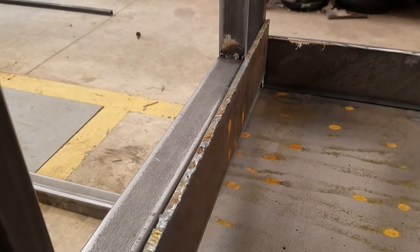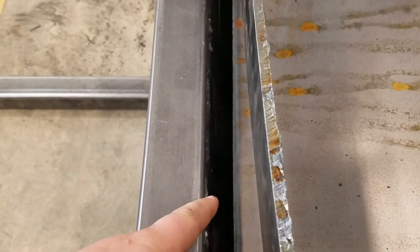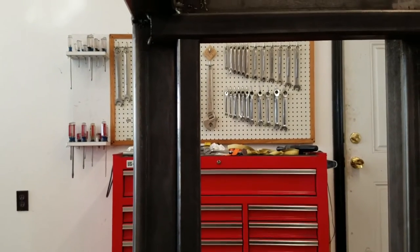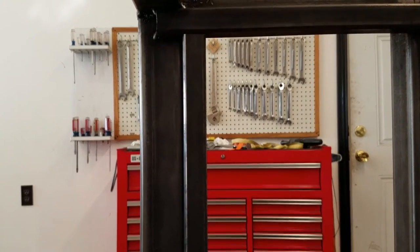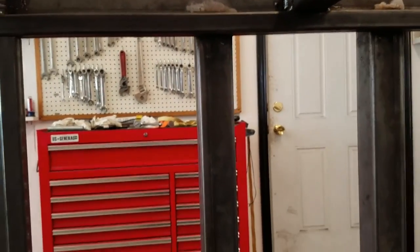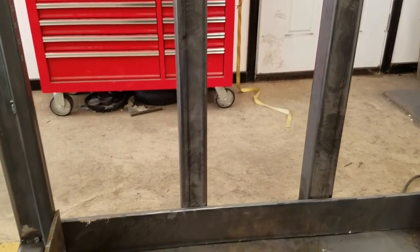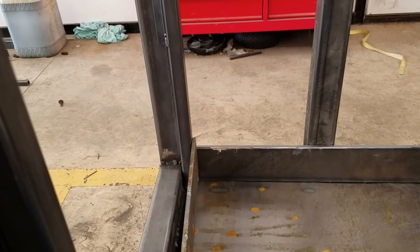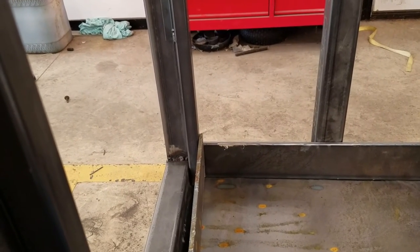That's probably going to flip over so we don't see it, or we may just grind it down smooth. When this gets ground in to fit, it's going to come over to the edge of the water pan, and then there's going to be a one-inch gap where the smoke and the heat come from. We'll have a panel on this tubing, and then an inner panel that runs all the way up — the inner panel is going to come up on that one inch and stop about four inches from the top so that the smoke has to come up that channel, across the smoker, down, and out the exhaust in the back. Everything else is going to have sheeting all the way around it, tight enough to hold the smoke.